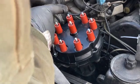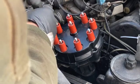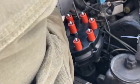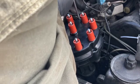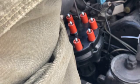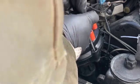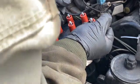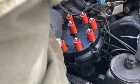And satisfying that we are going in here with nice fresh screws. Don't over tighten them, and also don't tighten one of them first and then the others. Make sure that you just have them hand tight until all of them are in and hand tight. There we go. Remember, after tight comes off, so don't overdo it. There you go.